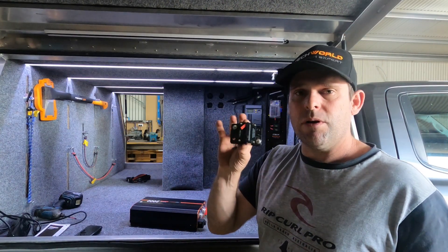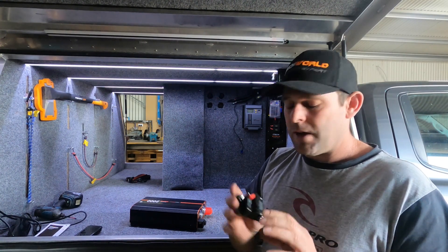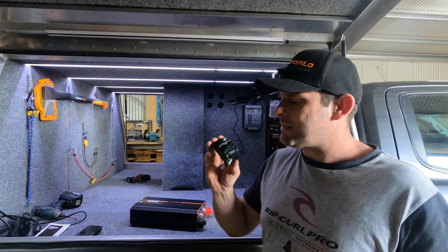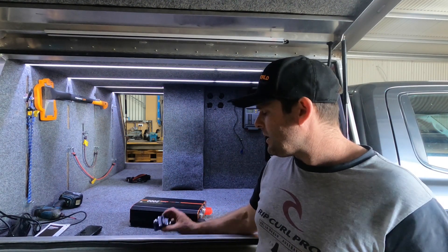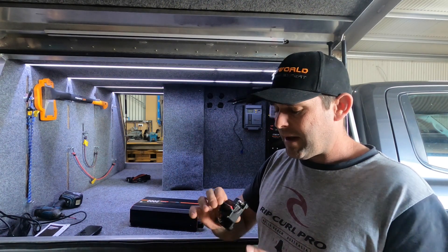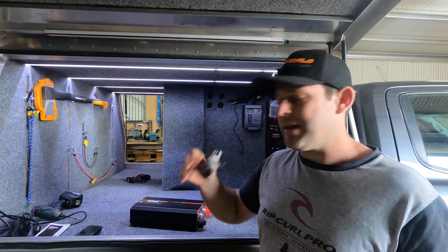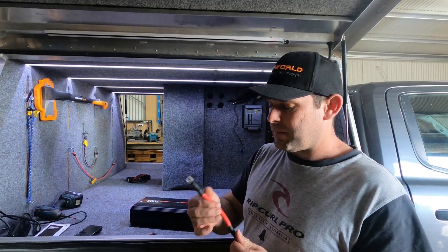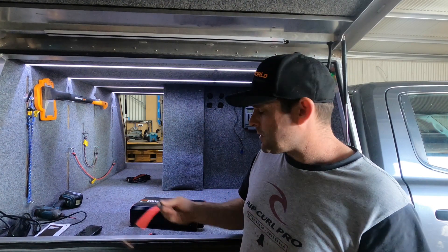The power needs to run through a circuit breaker. We've gone with a 250 amp resettable circuit breaker — you read the manufacturer's specs from iTechWorld and it states 250 amps. We've gone with a resettable circuit breaker because when you're dealing with something this big, if you replace a fuse it might cost you ten dollars. Do that ten times and that's a hundred bucks — just buy one of these, reset it, and you're good.